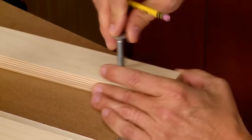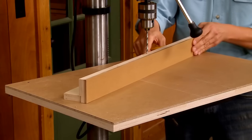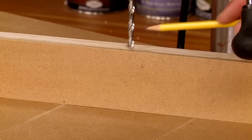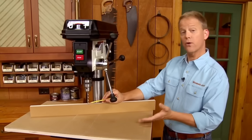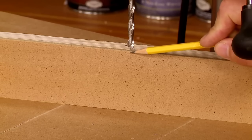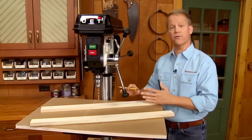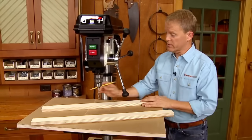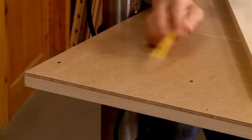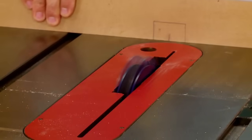The hole at the opposite corner is the start of the slot and will allow the fence to swing. I'll slip a bolt into the base and through the pivot hole, then swing it out. I'll slip the fence face in place and position things so the hardboard face of the fence is directly under the bit — that's where the notch needs to be centered. I make a mark, and while in this position I also drill a through hole to create the end of the slot. Later I'll connect those two with the slot, but for now I need to create the notch in the fence face.